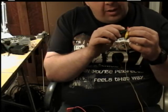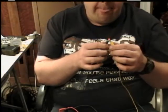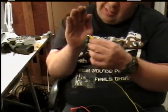And some diodes have a marking on it — like this one here has a flat side on one side, and that marks the cathode on the cold side. And on the diode check, it'll put out just enough voltage to, if you can see it, make it light up just a little bit.